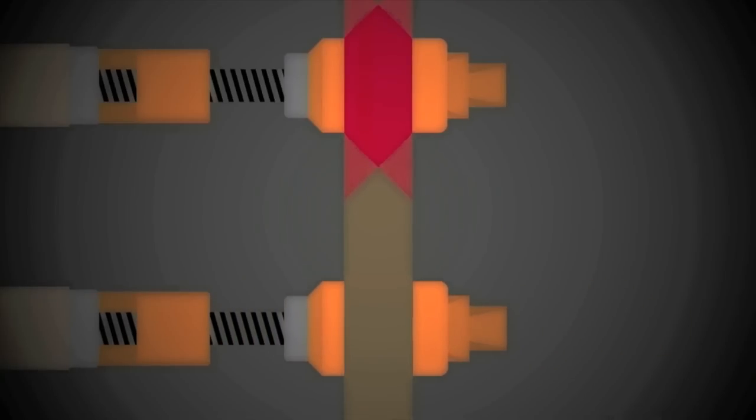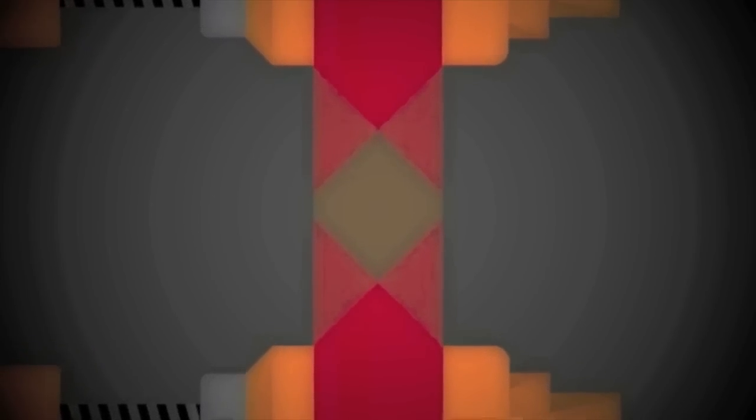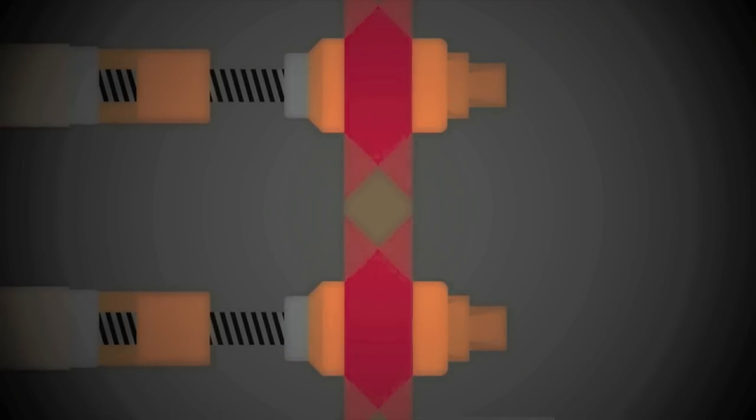Put on another clamp, same thing. The problem here is that if you don't put the clamps close enough together, you can get spots where there isn't any pressure, or not enough pressure to do the job. And with a clamping job like this one, there's only enough room for a couple of clamps. So here's what you do.